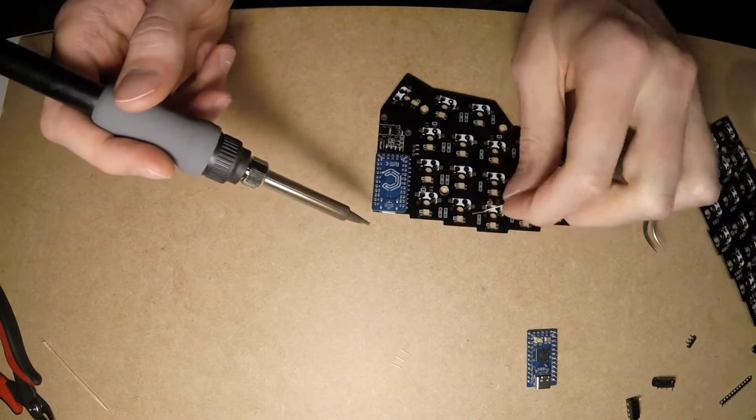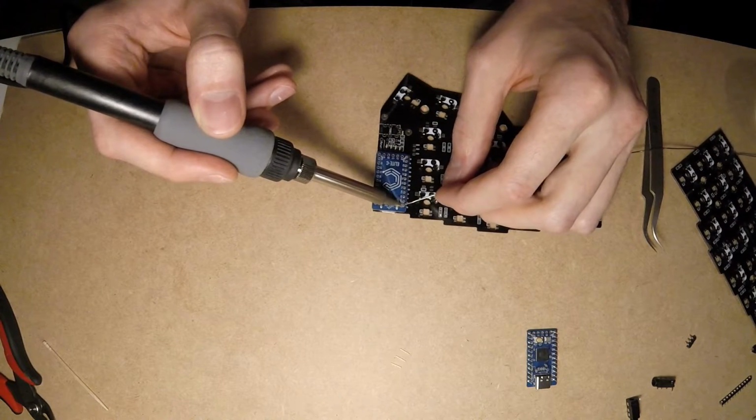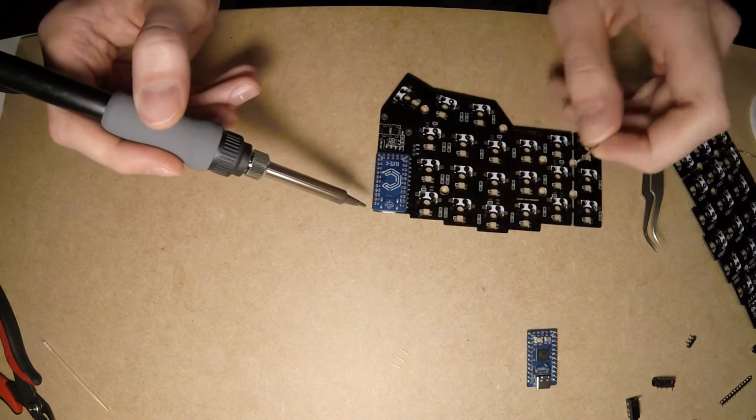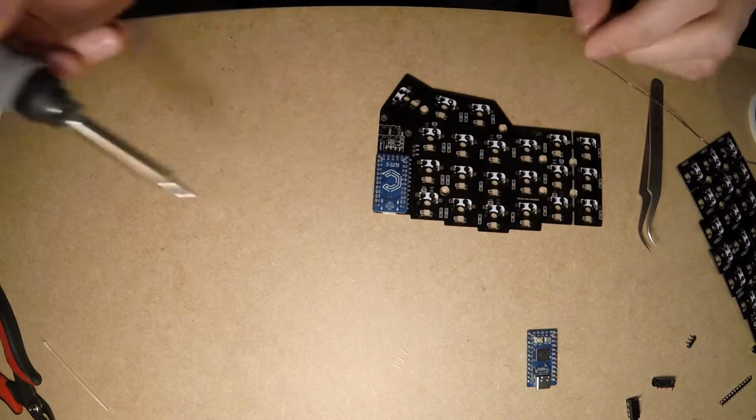To align the board for proper soldering, find something as big as the USB Type-C connector and put that on the opposite side between the boards. Solder 4 corner pins and check if everything looks good. If so, go ahead and solder the other pins.